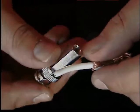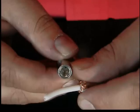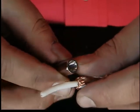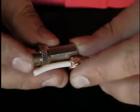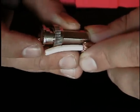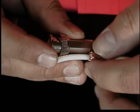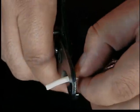Now, typically the inside of the connector only has about a quarter inch of thread in there. So I would ballpark it right there, and you have your center conductor at the length of the connector. Let's go ahead and maybe cut it halfway here — we'll strip a little piece.